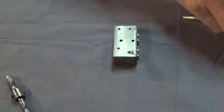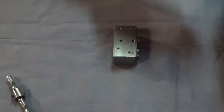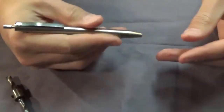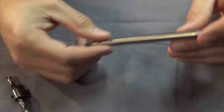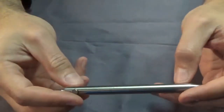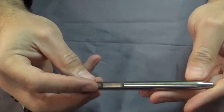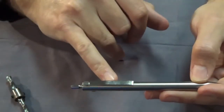I went with a 3/8-inch diameter on the pen body. I think that feels right in the hand. I'd go around the office and try out different pens to get the length I wanted, the taper, the diameter, the base diameter. It's kind of a fun thing to do. If you've got a metal lathe that'll cut threads, you don't have to have a thread cutter but it makes things simpler, especially for putting the threads on the back body.